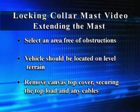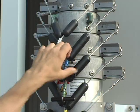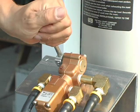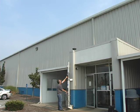After securing the top load and any required cables to the mast, pull firmly down on the top T-handle attached to the smallest collar. While holding down the T-handle, pressurize the mast using the air control valve to extend the first internal mast section.